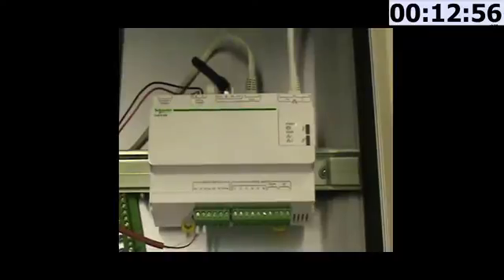Under the data logging menu, you would have to configure the logging interval. Under the publication table, you would have to set up the publication platform for the COMEX200. Under communication settings, the first thing to verify is the Modbus serial parameters — they have to correspond to the way your meters are connected to the serial port of the COMEX200.